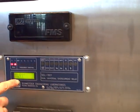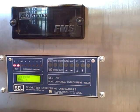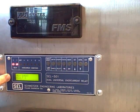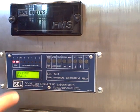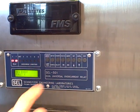I did want to show you something over here — the display does say Fault X. It picked up a new event; it recognized that we did exceed the pickup value and displays that we did go over the pickup value, but we didn't trip because we weren't high enough for long enough. We were not over the pickup value for 5 cycles worth of time.